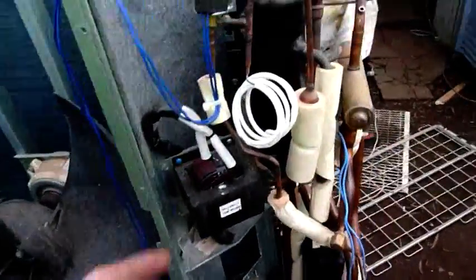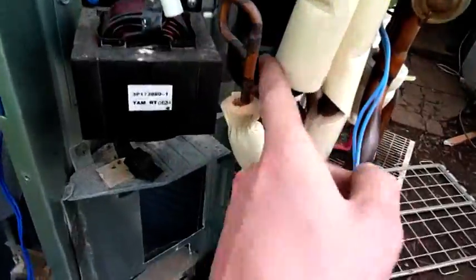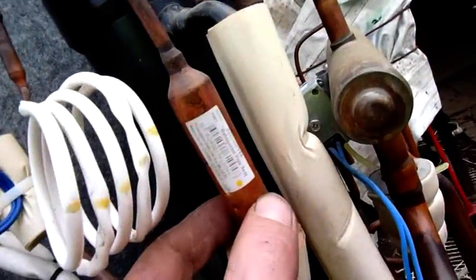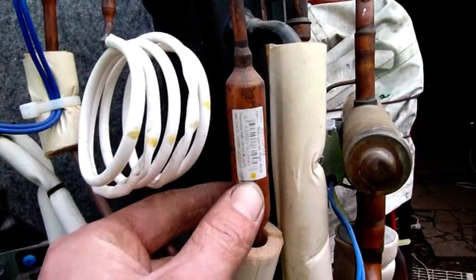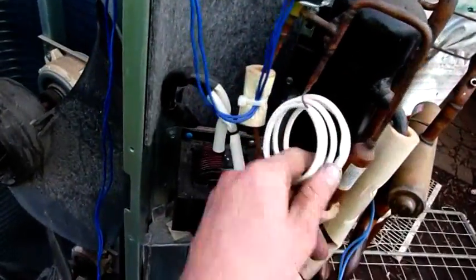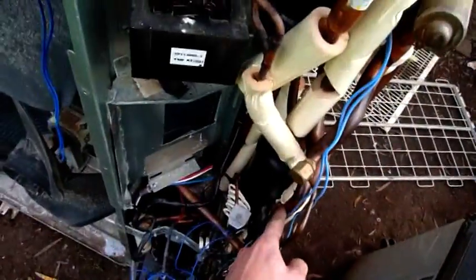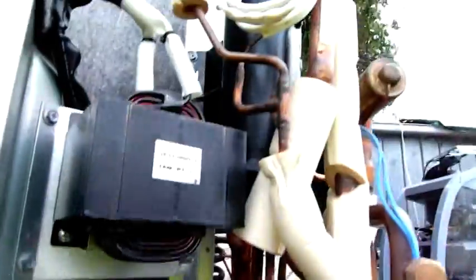It's strange how this thing dumps pressure from the discharge side. It dumps it down through this line — the line comes out of the vessel, goes through this little thingamabob that's got something in it; you can see little crimp marks. Refrigerant pipe assembly, ARC ZQ 160 PV 4A, October 2006 — so it's only a 2006 model, pretty new. It dumps it through the solenoid valve through the capillary tube. Actually, sorry, that's a bypass — that's a constant feed through there back to the suction line, and that's a sudden dump.